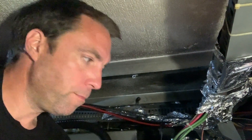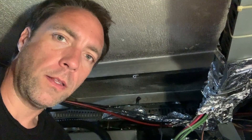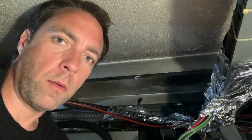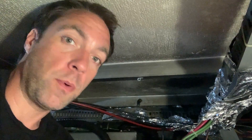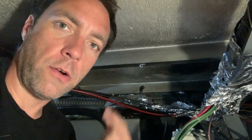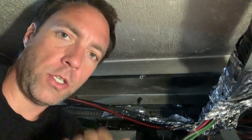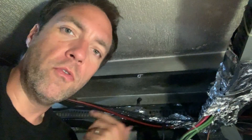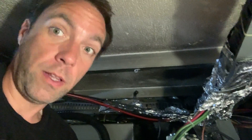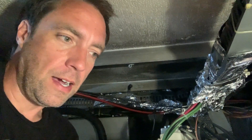Colette had a really good idea. Normally when we have been running the generator, we use only one of our blower fans. In the engine room of any boat, there are blowers that pull any sort of gas vapors that might be in here out, so you don't have an explosion when you start your engine. I'd only been running the one right next to the generator, but I ran all three — the generator and each engine have their own — hoping that would just move more air through and keep the air in here cooler. It's definitely warm in here right now, but it's also a very warm day, so it's really not too bad.